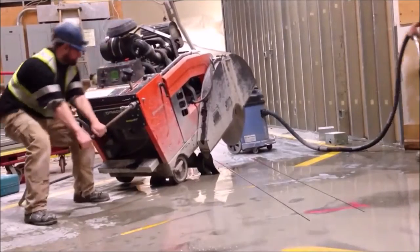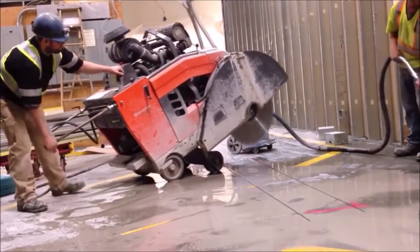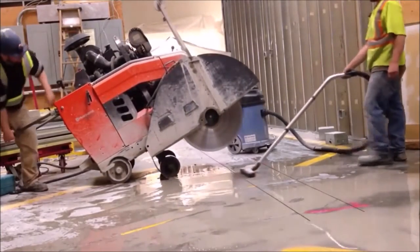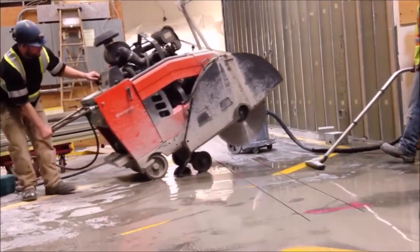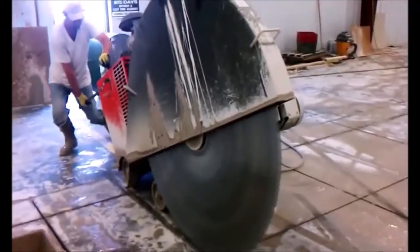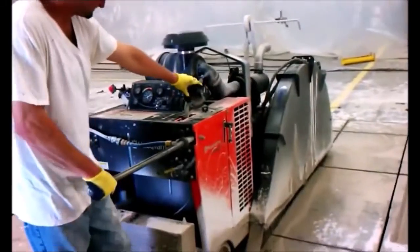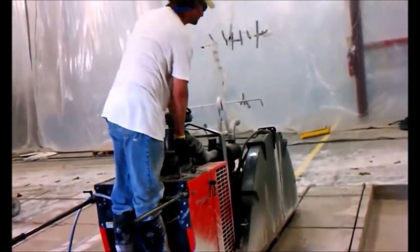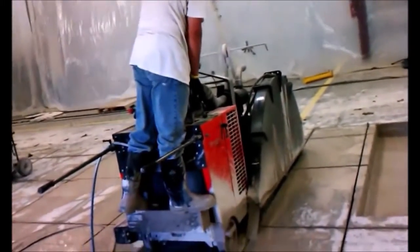The following three movies demonstrate typical concrete cutting jobs. The first movie shows the manual handling and slipping hazards that the operators have to deal with on a regular basis. These saws are extremely heavy when the blade is raised for turning purposes. Once the saw is lowered for cutting, there is no weight on the drive wheels, forcing the operator to stand on the back of the saw in a dangerous fashion to prevent these wheels from slipping in the slurry.